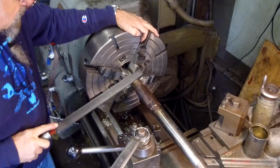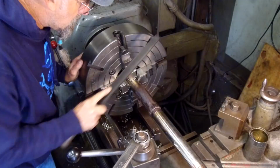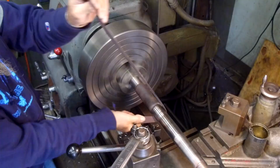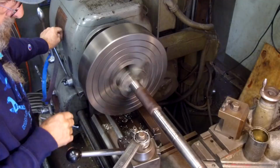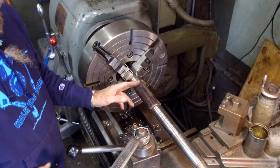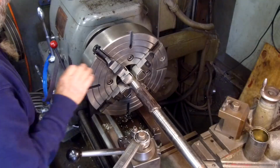All right, anything on this side here? Little one there. These are lines from the wear of the cutlass bearing in this area right here. The cutlass bearing diameter was good here, at least within a couple thousandths, and then we had a dip in here, and I just wanted to make sure that bearing has a full surface in here. While we're fixing an area, we fix the whole area that we noticed is low. So, better to be over welding than under welding.